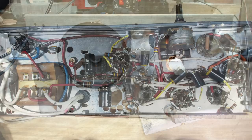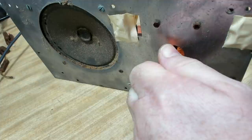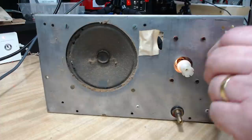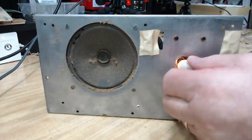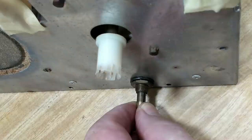I've turned the radio over again - I'll just make sure it's working, it's all warmed up. There's a bit of noise, a bit of crackling going on. There might be some dirt still in that tuning capacitor, so I'll go and blow it out again. Also it's really hard to turn and it's got a loose area - that'll be the bearings rolling back and forth hitting each other. You can turn it easy in some places and then it gets tight - it'll be the little ball bearings in the front.